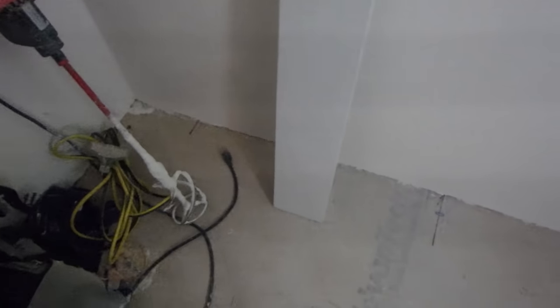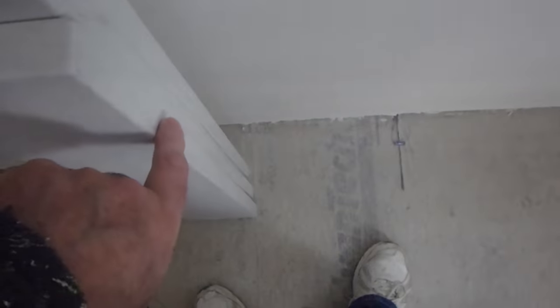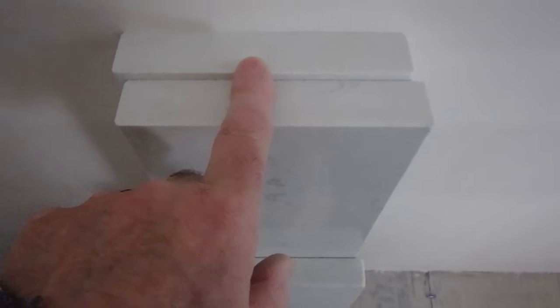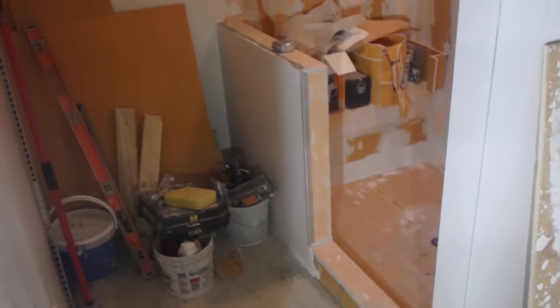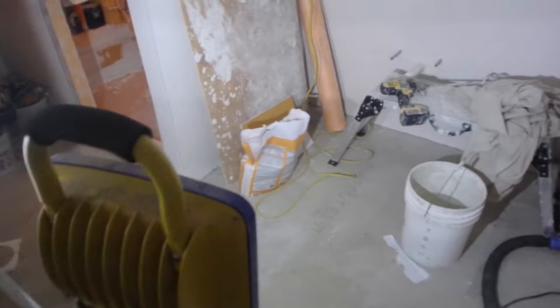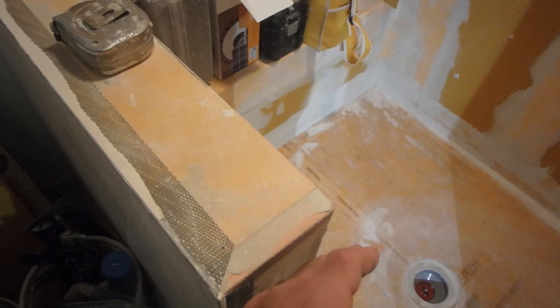The curb here has one edge, both ends and both sides polished, because it's going to be wider than the threshold over there, so you want the exposed edges to be all finished. The sills here for the top of the knee wall and for the going up, both sides are finished, and they forgot to polish one end. Because the top piece that goes over here needs to be exposed, that needs to be polished.